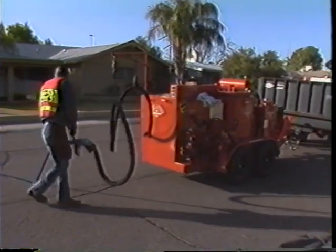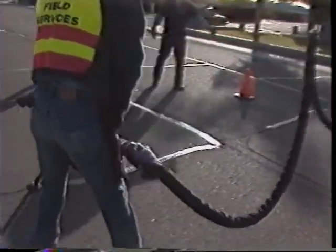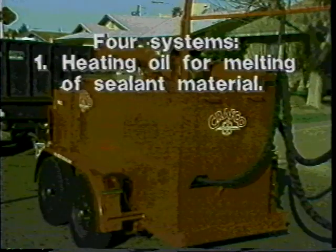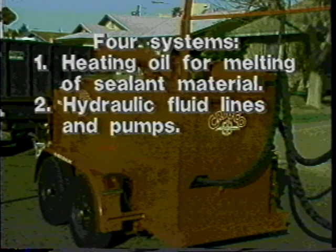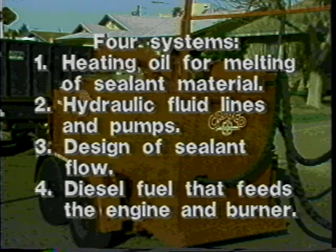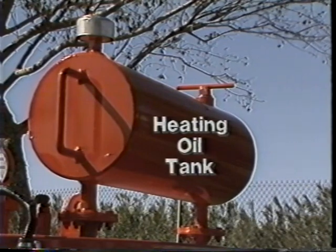The Easy Pour Diesel Melter applicators are designed so that no direct flames touch the sealant material. There are four systems that interact. They are the heating oil for melting of the sealant material, the hydraulic fluid lines and pumps, the design of the sealant flow, and the diesel fuel that feeds the engine and burner. The burner thermostatically controls the temperature of the heating oil automatically.